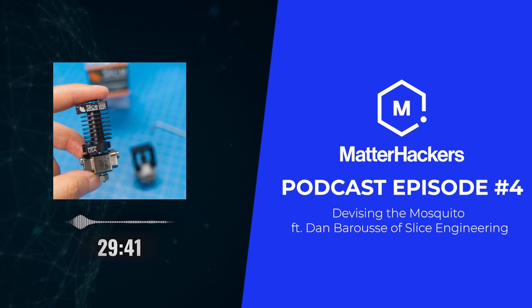We do something kind of weird in the industry: we don't use set screws or clamps to contain our heaters and sensors. In injection molding, you typically install a heater into a mold with a thermal paste and retain it with a screw to keep it from backing out — and that actually extends the life of the heater because it's not under any circumferential load. That's why we do it that way. We certainly get a lot of questions about it because it's weird in additive manufacturing, but it's not weird in industry as a whole.